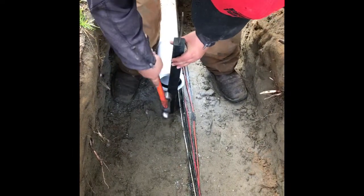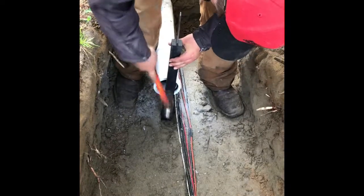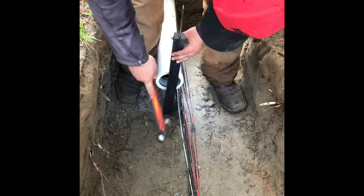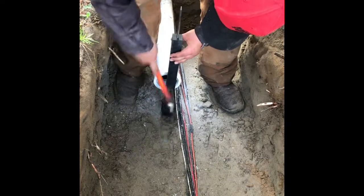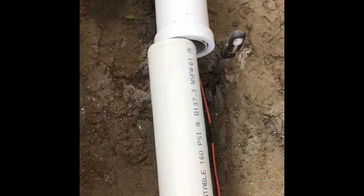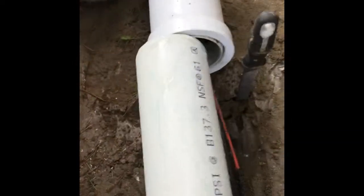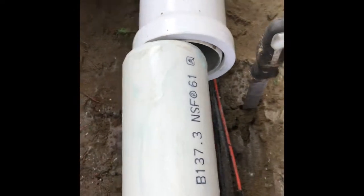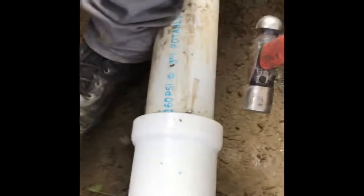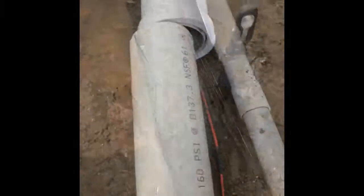After the edges were beveled, I was able to slide our brand new bang-on on simply by putting some lube on the pipe, as you've seen how I did before, and tapping it into place. The final step in putting this valve on is hitting the bang-on onto the other piece of pipe. We have them cut so they're going to be perfectly matching with a very small gap. In order to put the bang-on on, you'll just tap that over, but with our limited hands we won't get actual video of me doing it.